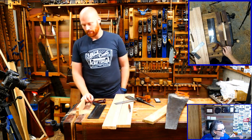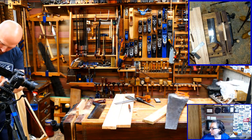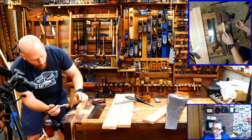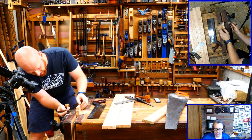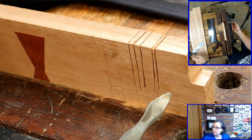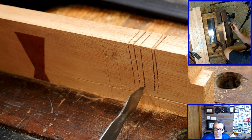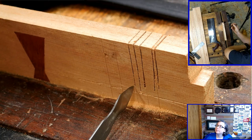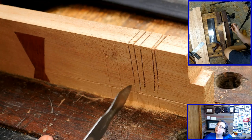Greg Cheng asks about darkening the knife line with a pencil - let me zoom in. You can see knife line, knife line, knife line. The first cut came off about three millimeters. After three passes it veered a bit more the other side - about a millimeter or two. After a couple more strokes it was just on the line, so I did one more pass and cut down the middle. Now I have a nice straight cut.